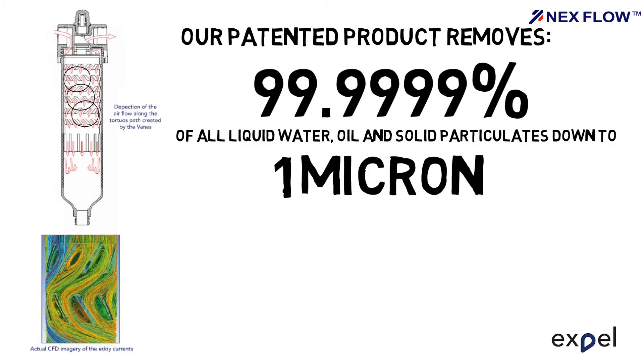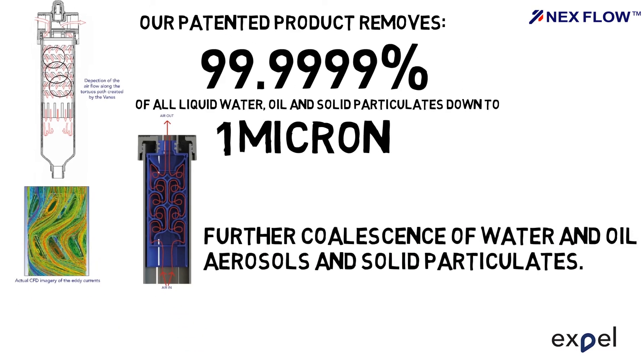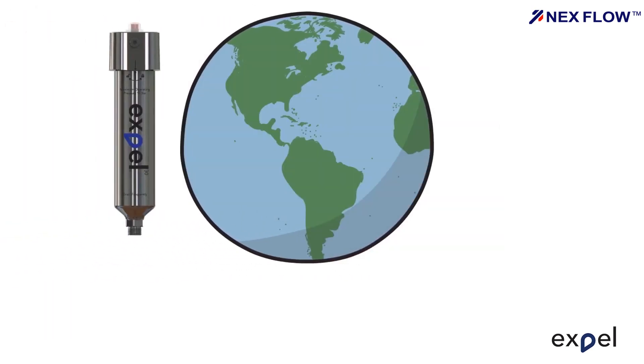The compressed air is then directed into the inner chamber, or UVB. The umbrella-shaped chambers act as the final polishing stages, thus causing further coalescence of water and oil aerosols and solid particulates. These smaller droplets in turn fall to the drain port through gravitational force. Treating compressed air is a hugely costly exercise, with ongoing maintenance being a significant factor.